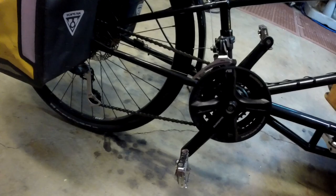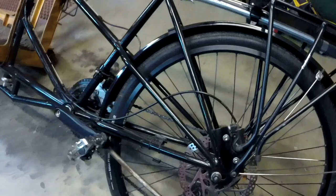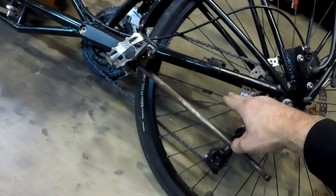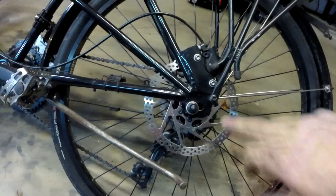I've modified the brakes. Here on the back of the bike I have the rear brake — the frame did not come equipped to accept a disc brake. This mount I had to weld on. It was originally equipped with a big drum brake, and there's a tab sticking down that would stop the bike. But I didn't want to use that, so I welded on a tab to run a standard mountain bike disc brake — I think that's a 180 — with a hydraulic caliper.